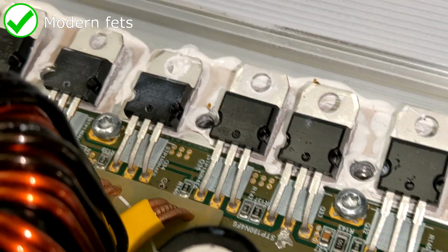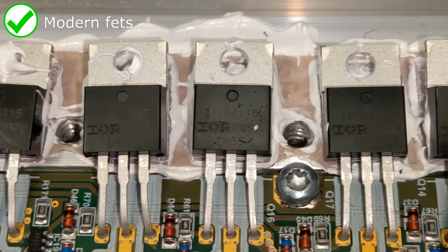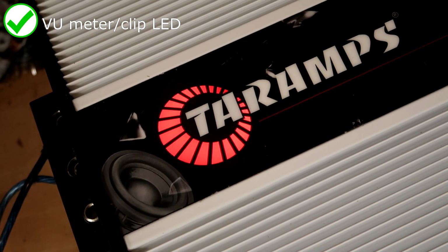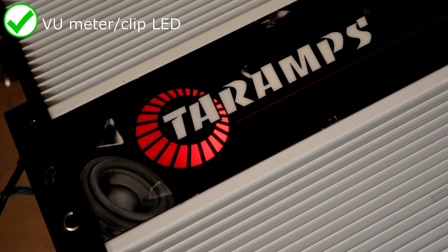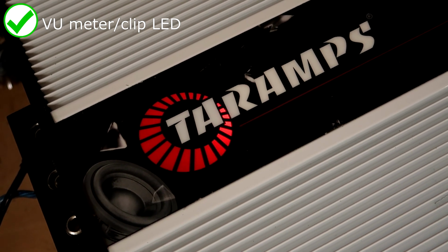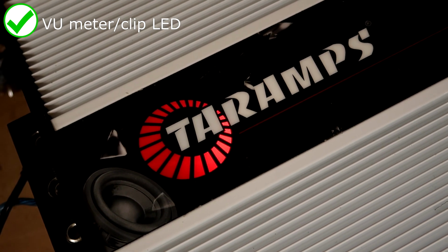Modern, low resistance, high current MOSFETs are used throughout, making for an efficient, cool and compact amplifier. The VU meter on the front is a fantastic addition. This tells you exactly how much headroom you have left in the output, showing you how far away you are from the output voltage limit and ultimately clipping. I wish all amplifiers had these.